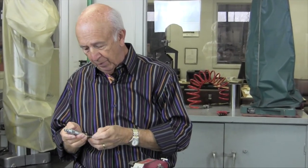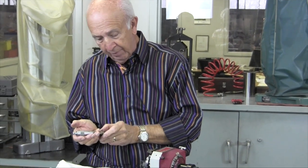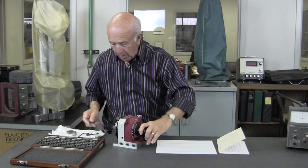I'm talking about mics for just a moment. I have my own micrometers that I don't let anybody use. Why not? Because I know the feel — I can split tenths with this thing. I can really feel it when it's right. And I can take a look at it and confirm that's exactly what we're supposed to have. So it's a good idea to double-check the blocks with micrometers.